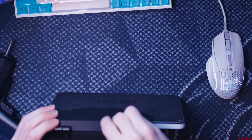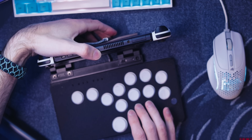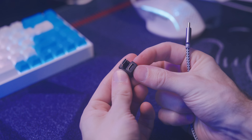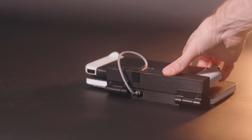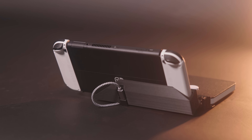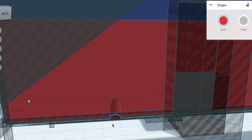The last little bits are the micro USB to USB-C cable. I think the newer Snackbox Micros use USB-C cables, so make sure you get whatever cable works with your setup. I knew I wanted to use some sort of angled USB-C adapter, so I ended up with this particular one because it doesn't get all bunched up when the clamshell is fully open on a table. I incorporated that into the design, and at the very last minute I made a little notch in the 3D file so the unit can sit flush on the table with the cable sticking through.